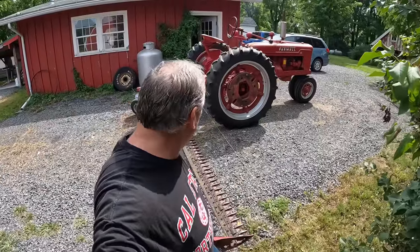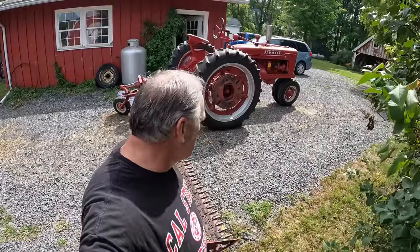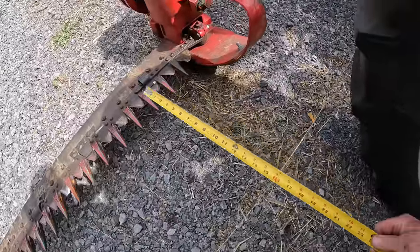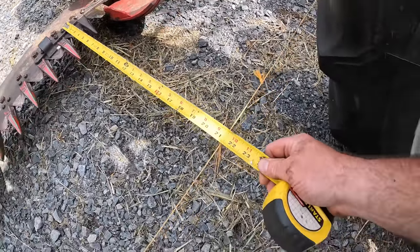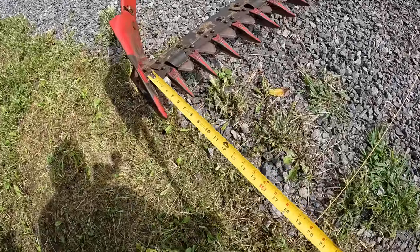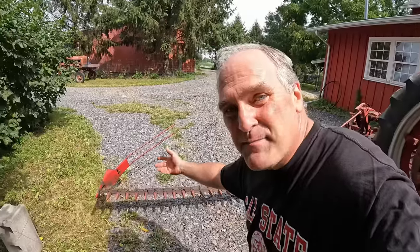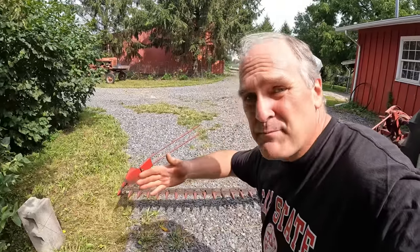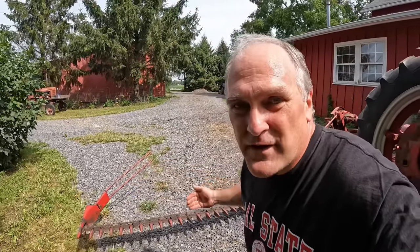To fix this, I set up a string along the back wheels — it's not exact because you're dealing with lug wheels — but I got it running as close to a right angle out from the tractor as I could. Then I took measurements on the sickle bar per the manual: the back of the knife to the string on the inner end is 21 and a half inches, and the outer end measures about 20 and a quarter. That means I have about an inch and a quarter of lead on the outer end. In the field, the bar deflects backwards a little from the load of the grass and you wind up with a fairly straight cut at a right angle to the tractor.